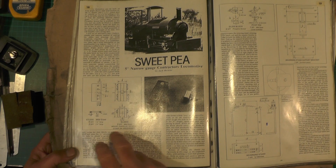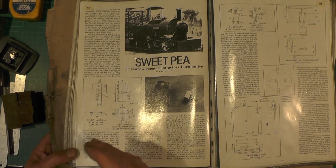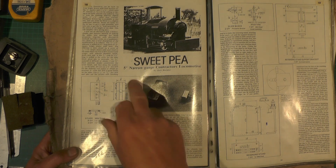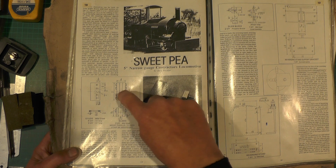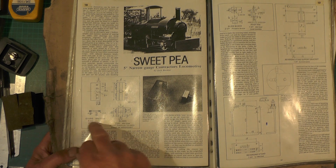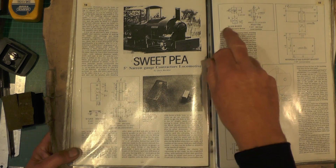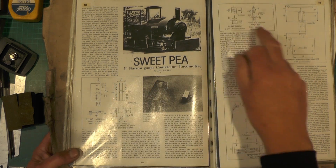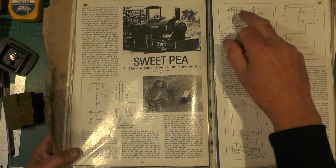I'm going to take a look at the slides next. Everything I do now there's going to be two of everything to make — that's one for each side of the loco. The slides actually come off the way shaft on that pivot point in the centre. There's the slides to make, a couple of studs, the actual slide blocks over here that run in these slides, and then there's the pivot pin that fits into the slide blocks.